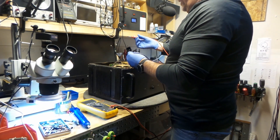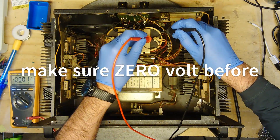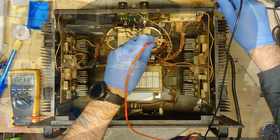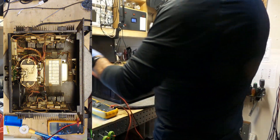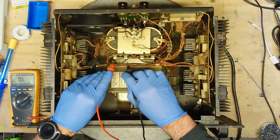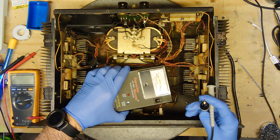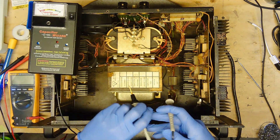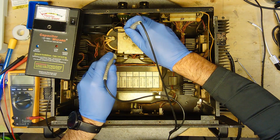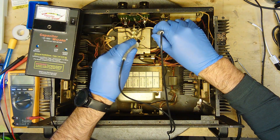Let's see if I have any voltage on my capacitors. There's no voltage, so I should be able to check these out. There are some fuses here that I'm going to check. These are okay. I should get the needle all the way up when I'm testing this big cap, and I do - this is a good cap. So these caps are good.